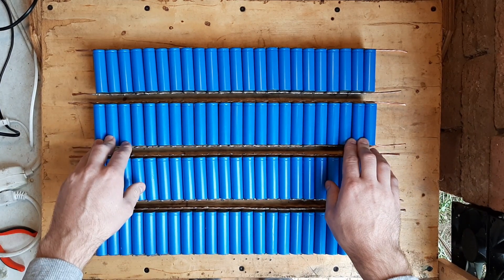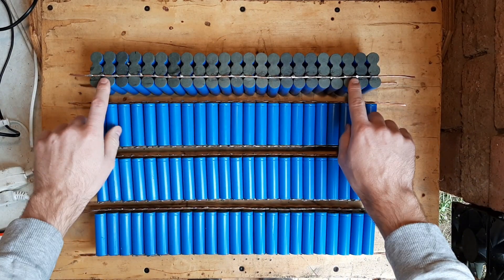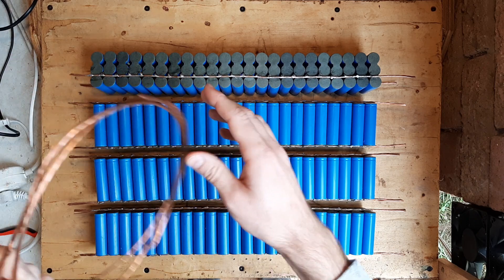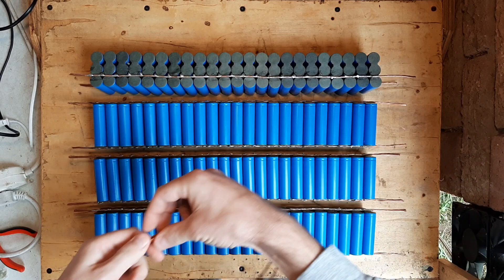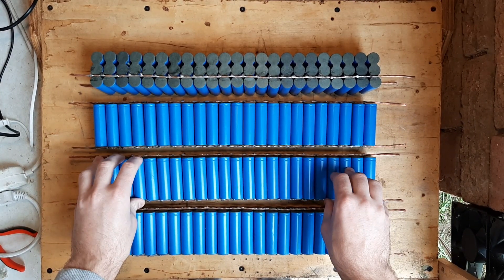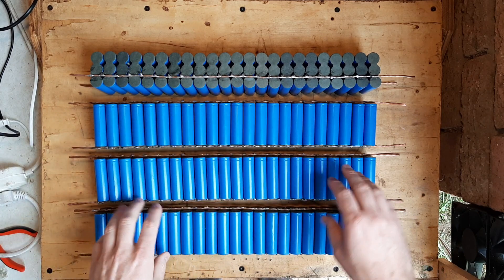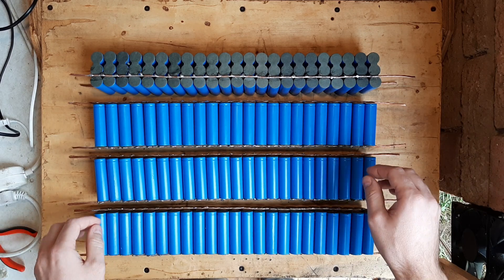It is important to note that these little busbars that we have on here are very thin. So you would want to increase them — that is definitely what we will do. We will double them up on the top and the bottom, add another one so that we can carry more current. Ideally you would want to go even thicker than that. But this one is just for backup purposes — we are definitely not going to run it at a 5kW load at all. It is just to carry a base load if needed.